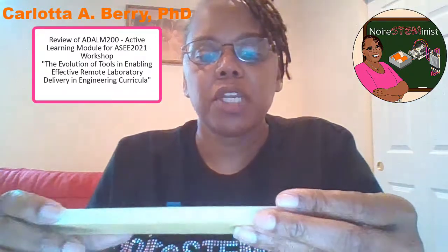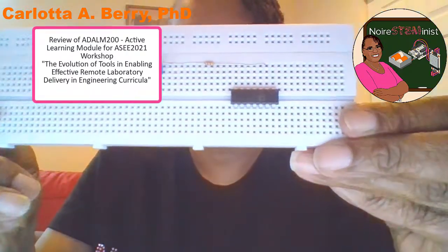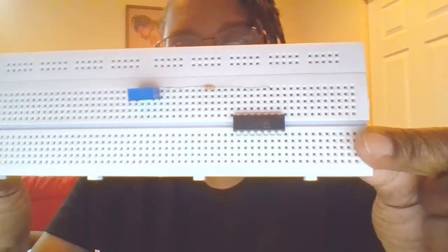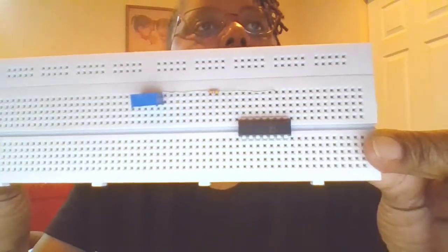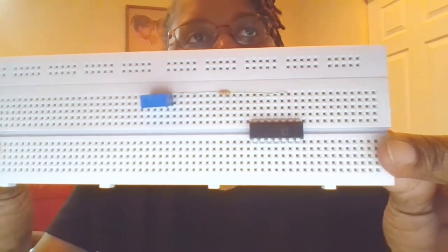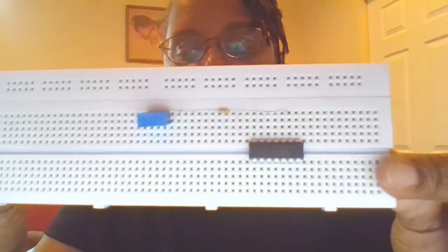Okay, so here are my first three connections, and it is the op amp, the 4.7 kilo ohm resistor in series with the potentiometer. Next, I'm going to wire up R3, R4, and my two diodes and check back in.